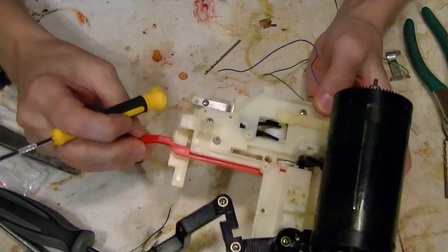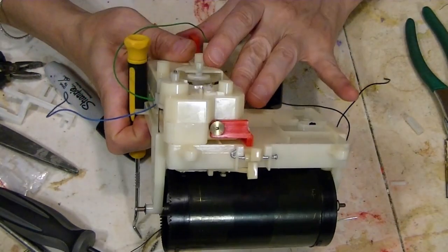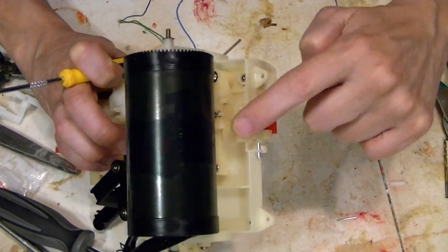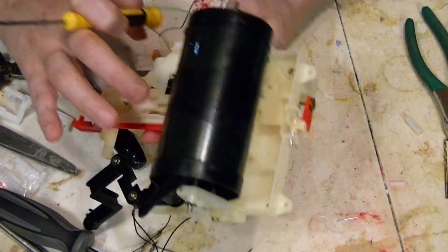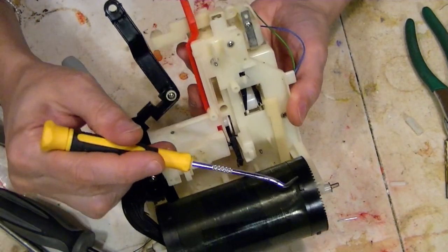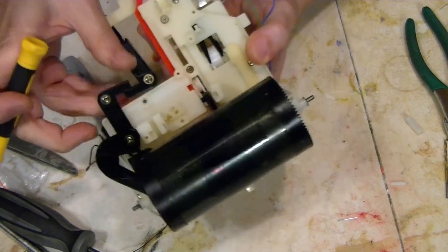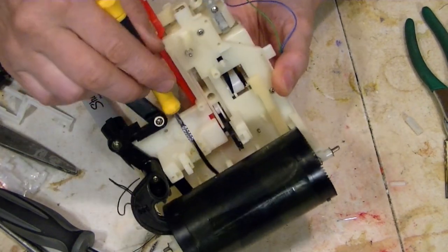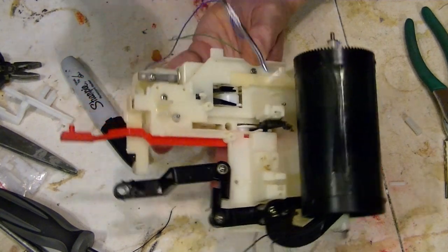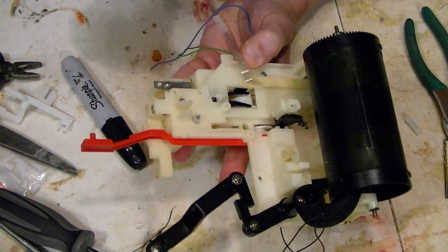Okay, here's how it works. So here's your gear shifting here, okay? And it's moving this out. So now, when it's all the way to zero, that's holding this out so that this can't move back. And that moves back only when this is turning and these little notches right here happen to hit one of these pegs down here that is connected to the arm here that moves back and forth. If it does hit, it pushes it. And you can see right here how it moves this.